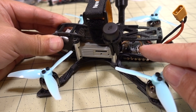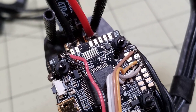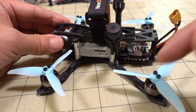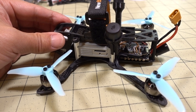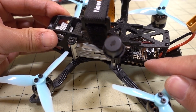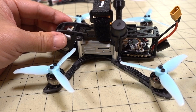If you don't want to do the soldering here — obviously you have to solder the wires to the flight controller, and I'll put a picture up here of what that looks like, a little close up. I did a video on how to wire a DJI air unit to a flight controller, I'll link that down in the description as well. It's pretty basic. There's only six wires you have to actually solder up to the flight controller, and you just follow those instructions. I used UART1 for the S-Bus, and UART2 for the MSP connection for the air unit, and that's pretty much it.